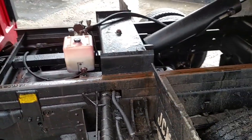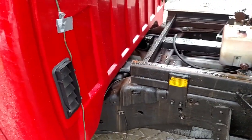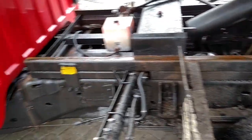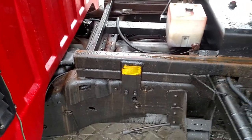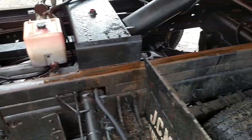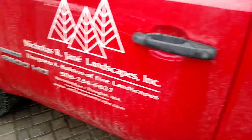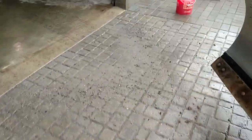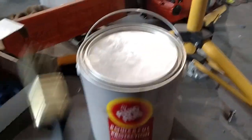As far as frames go too, and salt resistance, spend the money to undercoat your truck. Either undercoat it or do some preventative spray. We undercoat all of our trucks and that usually lasts a while. Then we use a thing called Fluid Film, which is a really good preventative for rust — you just spray it on. It's kind of like an oily coating and it just prevents stuff from sticking and getting to the frame. It's really inexpensive; you can buy it at your local auto parts store. It's like 45 bucks for a gallon.